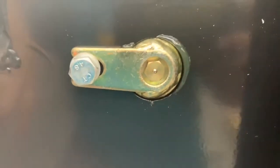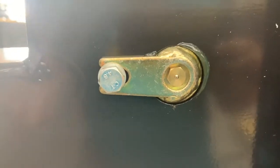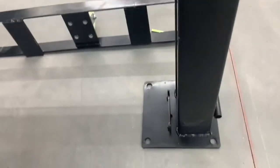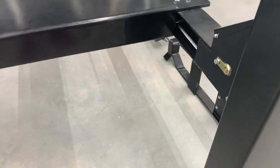There's a little grease zerk that goes in — I found these at the end and didn't really know where they went. There wasn't any clear info, but there are eight of them and they go inside these pulley retainers. Also, for the legs, the wide side points towards the inside of the lift.